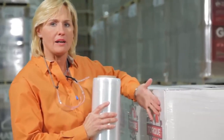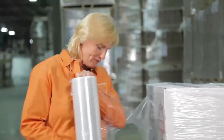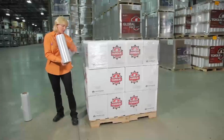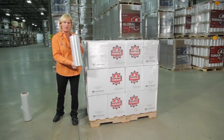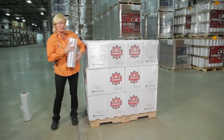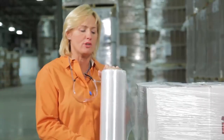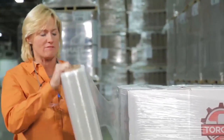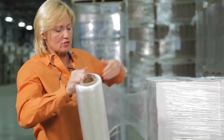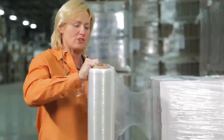Here's the second thing you can notice: I'm wrapping with the film away from my body. So many workers in the warehouse actually hold the film with it up against their body — as you can see, it's leaning up against my elbow. It might catch on a watch or a ring, and you're going to stand a greater chance of tearing the film. So we just ask you to flip the roll over and unroll the film so that the film is away from your body and up against the product. You'll also notice that I'm holding the roll of film with my left hand on top. By holding the roll with my right hand on top, the natural weight of my arms causes the roll to be at an angle — the film is very tight here and very loose down here, and you'll have a higher chance of tearing the film.